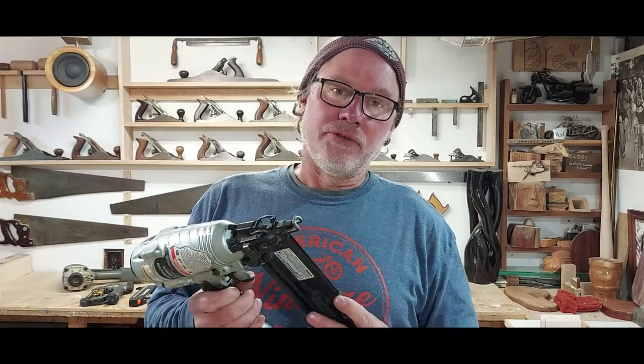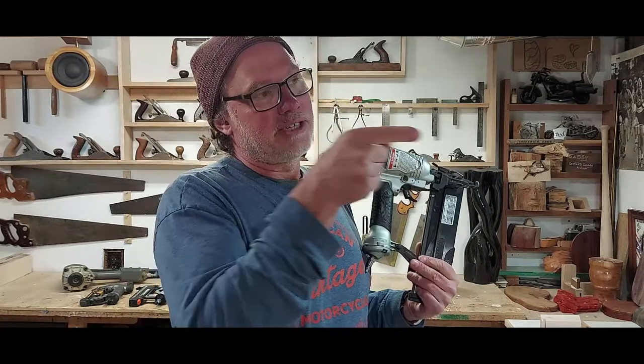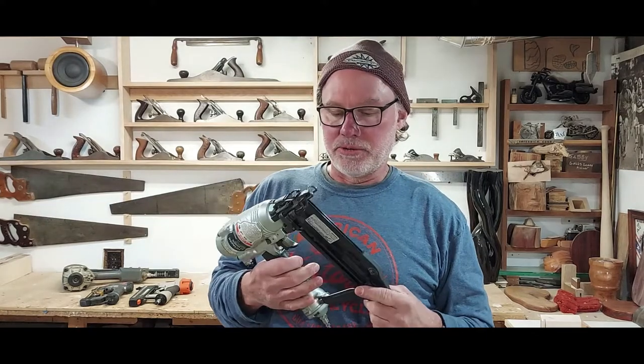The other thing that happens with these guns that you want to be careful of is when you're nailing something on the wall, there might be a screw or a nail or something behind it. You go to shoot into that and the nail will actually U-turn and come back at you. It won't come all the way back out, but if you have your hand near there and you shoot it and it hits one of those, it can come back and hit your hand. So always be careful — try to keep your hand away from whatever you're nailing as much as possible. Be conscious of whether this nail, if it hits something, is it going to be able to come back and get me. If you're careful about that, you should be in pretty good shape.